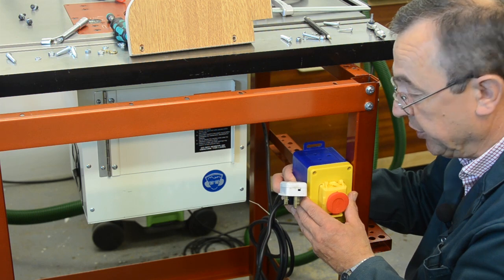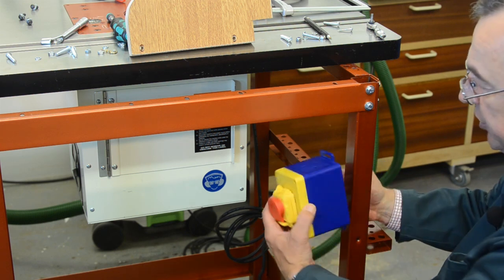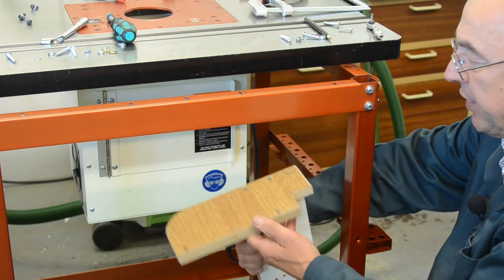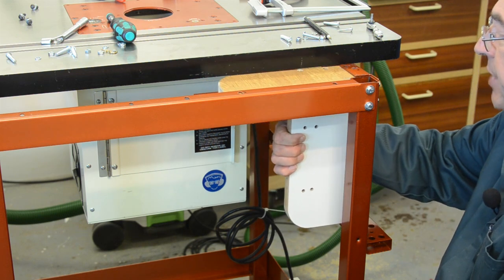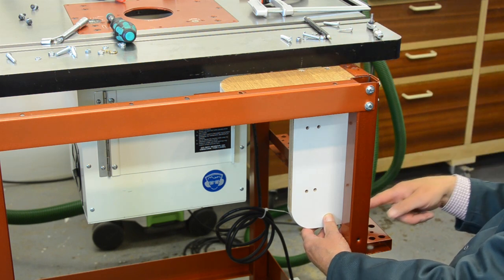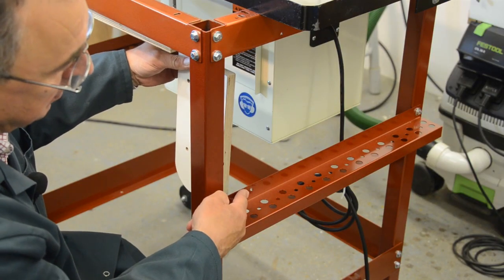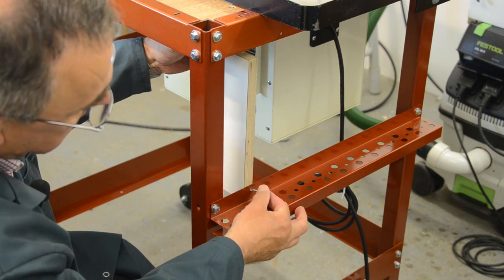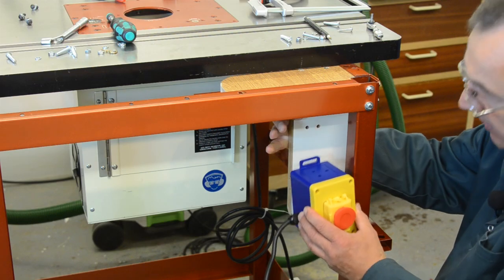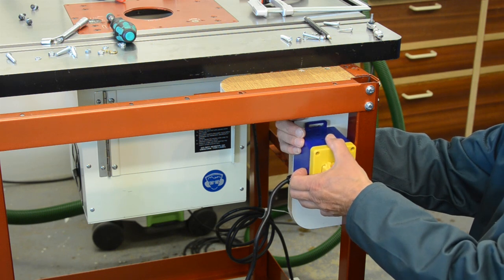The beauty of this is that when you're doing a cutter change you can remove the plug that goes to the router, which is essential when doing tool changes. There's no easy way to mount this — you can't really put it on a leg because it might get knocked, and it's not in the handiest place to get at. So I've made up a bracket. My bracket assembly goes in like so and is attached at three points at the top to the frame, with one attachment point here. This is the only modification I've had to do to the whole assembly — I've drilled one small hole in the flange of the tool storage bracket, which allows a screw to be screwed in at the bottom. The NVR switch goes on like so, flush here, with enough room at the top to get the plug in and out.